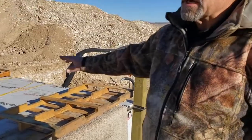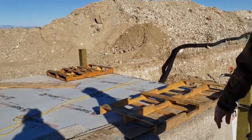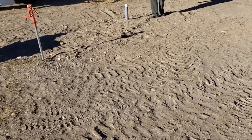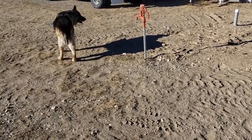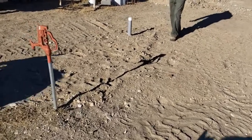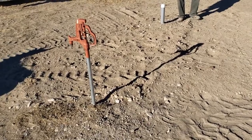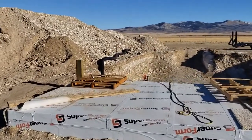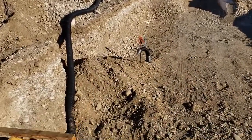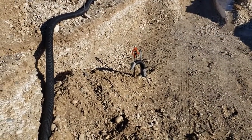Let's talk about the amenities — the water and electric power that we dug in before it froze. We went ahead and tapped our water line that was buried through here. Several years ago I put frost hydrants in a line through here, then put a tee in the line eight feet down and added a curb stop in the wall. Also, I had conduit run years ago and you can see it stubbed up and taped off so that water doesn't get into the conduit.